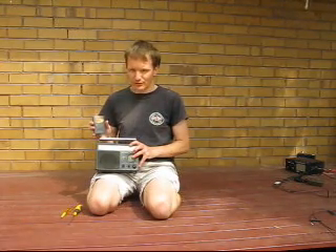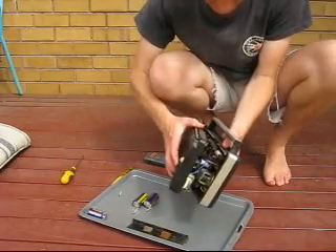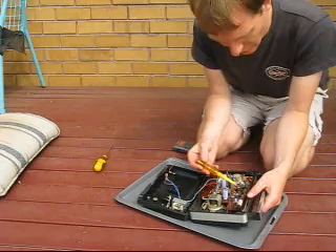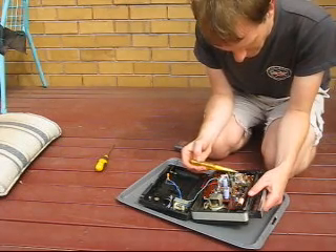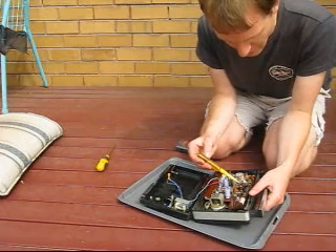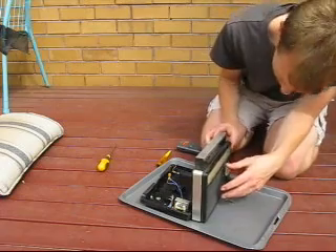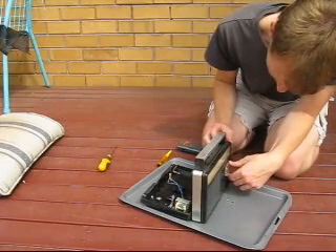We'll open up the radio and see if we can get this one going. We'll need some power, so we'll put the batteries back in. You've got to have a look around inside the radio and see what some of the various things do. The main items inside are the ferrite rod, which we won't touch; some of the adjustments on the back of the tuning capacitor, which we will adjust some of them; and possibly, if we need to, the local oscillator alignment coil. It's a bit hard working out which is which, especially if your radio has shortwave as well as mediumwave.